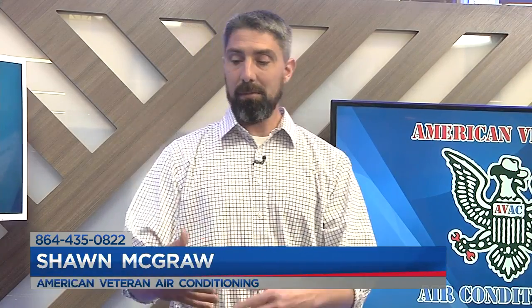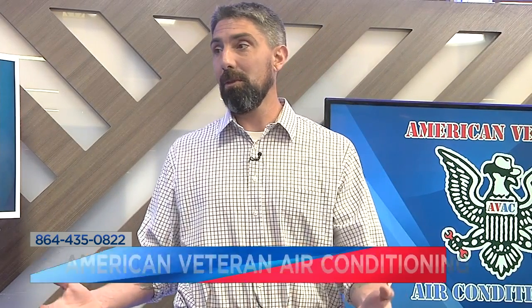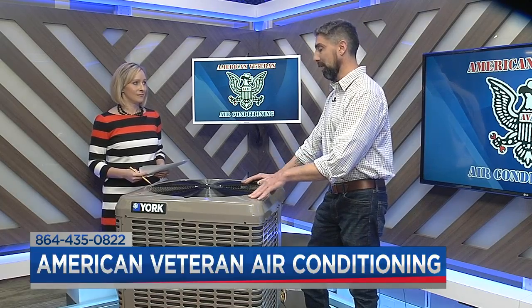For people who want their cooling system cleaned by a professional, you can call us. I recommend a maintenance contract. I look at it like my car — I don't just change the oil when I'm ready to drive to Florida. If it's always maintained, it's always ready to go. Unfortunately, we do neglect our AC systems because we don't see them; we just expect them to work. If it hasn't been maintained, it's a good idea to get it professionally cleaned — and by that I don't mean just someone rinsing it off with a water hose. You can do that yourself after mowing the lawn, just rinsing the coils off and making sure they're clear.